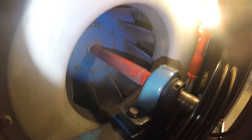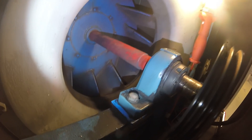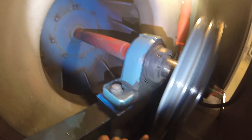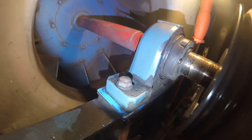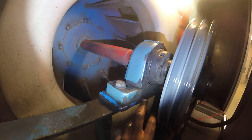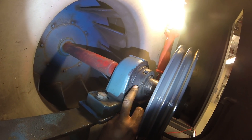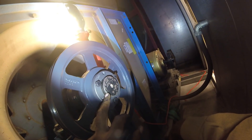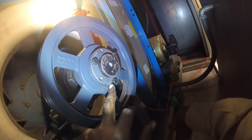That's pretty much all they're going to need — five things. One is the length. Two is the width. Three is the center of the bolts. Four is the base to the center of the shaft. And five is the shaft size, which is two and three-sixteenths inches.